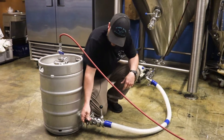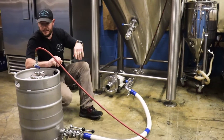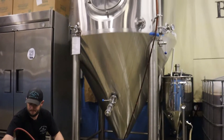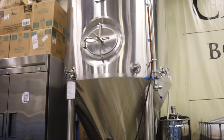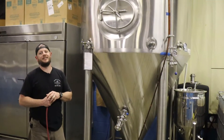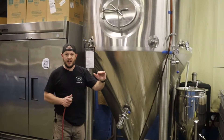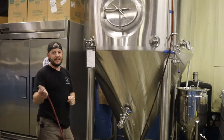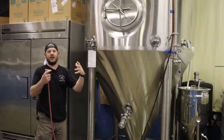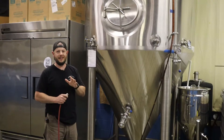From here I can open all my valves and begin to flow the yeast into the tank. We've got the yeast in the mash and our temperature set just right for fermenting rum. The last step is to aerate that mash and get it nice and oxygenated so that yeast really replicates and builds up an army to eat that sugar and turn it into ethanol.